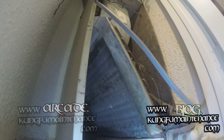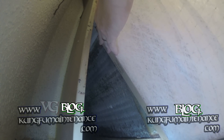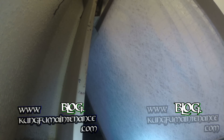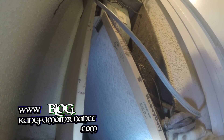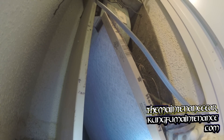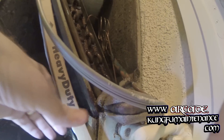You have to choose your approach to how you're going to handle taking care of your air conditioning system. If it's your own home, it's a lot easier to change it every month. If you have allergies, you might want to use what's called a HEPA filter — a high efficiency particle arrestor. It filters out smaller micron sizes, so for people with asthma and stuff like that they may want to consider that. But it's a much more expensive filter, about 25 bucks, and you really need to change it every 30 days, otherwise it's going to cause air restriction and you're going to have an iced up coil.